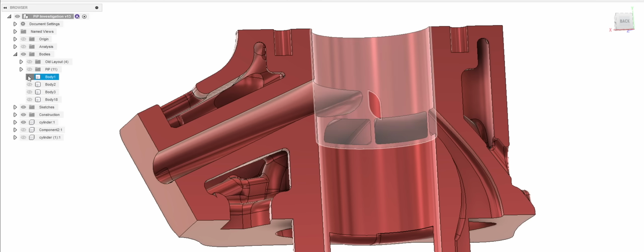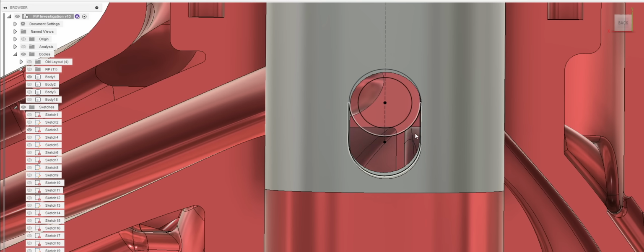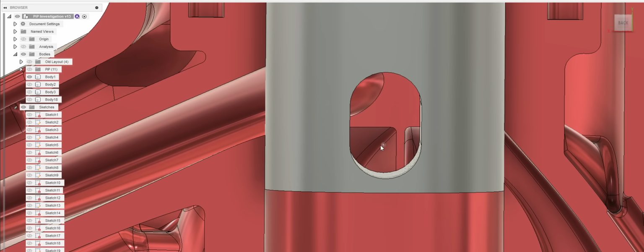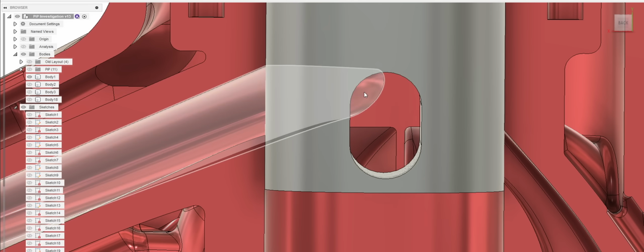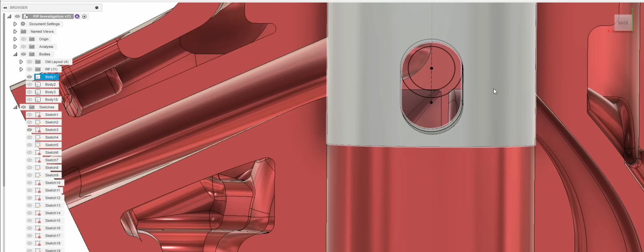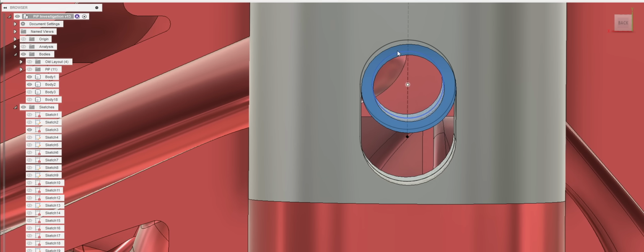And here's that wrist pin issue we're talking about. So the hole is actually sitting here at top dead center, and this slot corresponds to the range where there's communication between this A and actually a little bit of the B port and the exhaust port. And that's 7 millimeters. It's not as bad as it looks, because there's also a wrist pin in here, so that hole is effectively smaller.